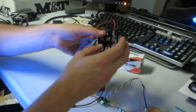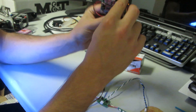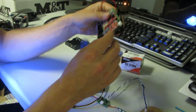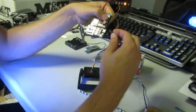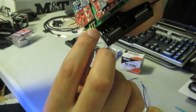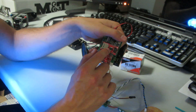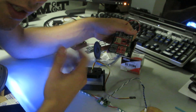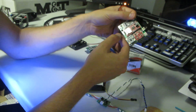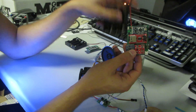If you got the complete package, there's a lot more going on. Still the Arduino, still the accelerometer, and still facing front and back this way. The JST for the eyes faces the front of your helmet, same as before — the servo plugs over here. On this board the metal tongs face this way, and the markings underneath say plus and minus. There's an audio amplifier for the SparkFun sound module, and a micro SD card comes included with custom sound effects already loaded. A nice 50mm speaker is connected securely through the holes, along with your power switch and the AA batteries.